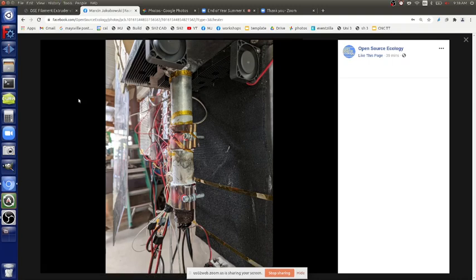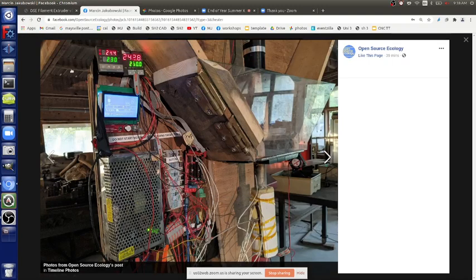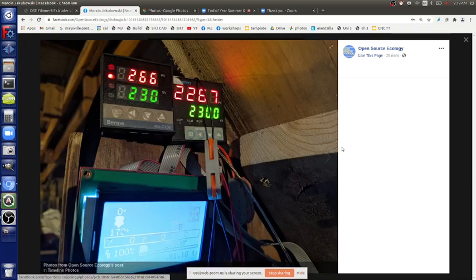Here we see the hot glow, which implies, I mean, glow starts at like 900F, so that's super hot. In this example here, this reflects some of the jumps that we have, like a set point of 230 at the bottom. After waiting 5 minutes or so, or 10 minutes, we were close to the set point on the bottom reading, but the top reading was actually much hotter.